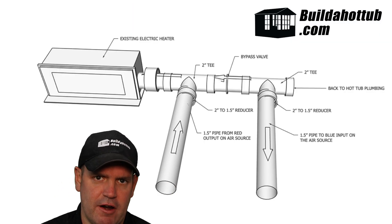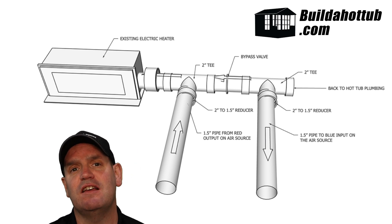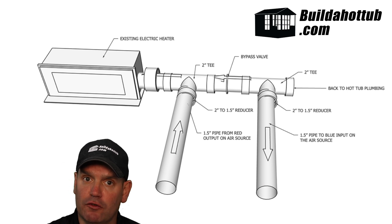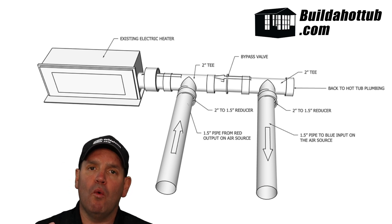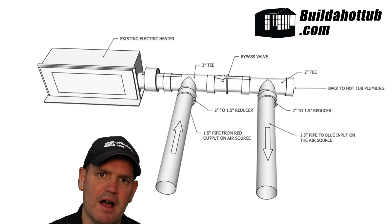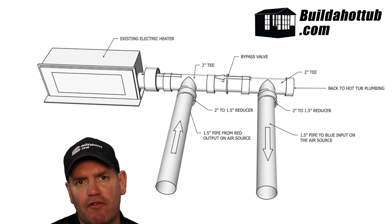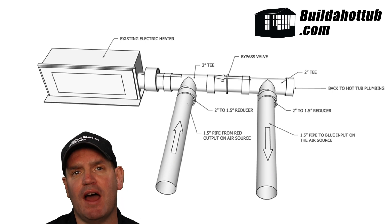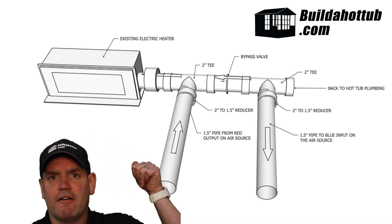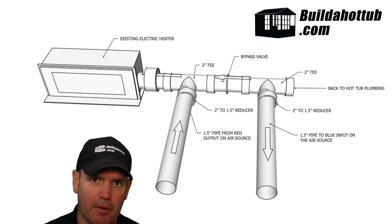Behind me is a diagram of the setup we were looking to do with Chris's air source heat pump. The reason is that he's on a single pump. A single pump means it's got two speeds — low speed for heating and filtration, and high speed for the jets. With a single pump system, we need to put a flapper valve bypass in. We don't want to put high-speed jets through the air source heat pump: firstly it can be too much flow, but more importantly it's actually going to restrict the flow to your jets. So if you don't have a flapper valve bypass in, you're going to lose pressure on those jets — and we didn't want that to happen. The diagram behind me shows exactly the method we used to put Chris's air source heat pump onto his hot tub.